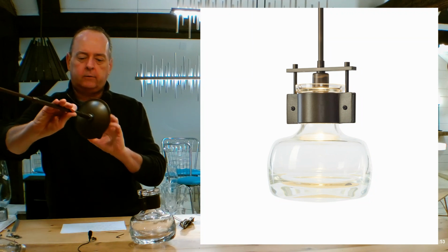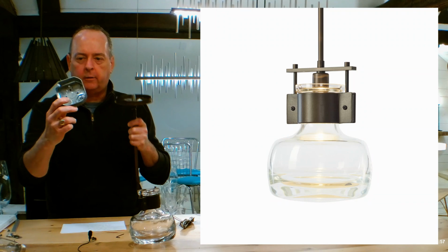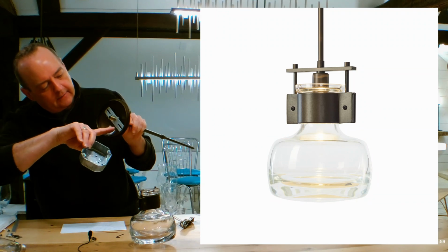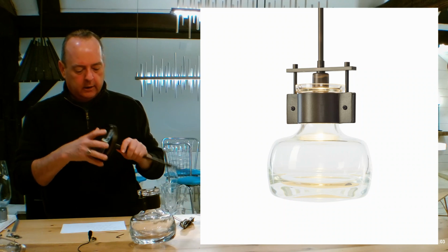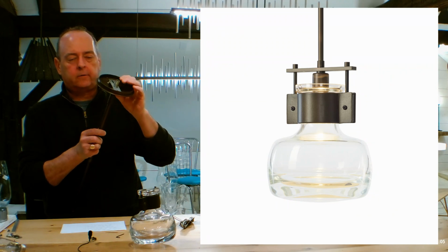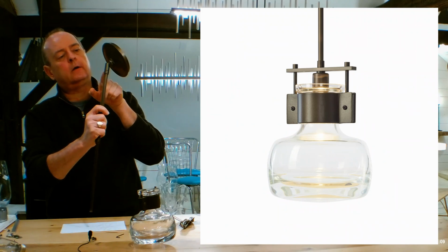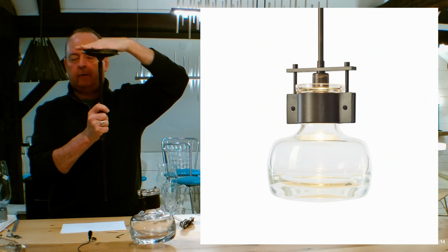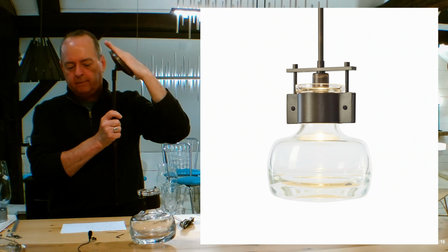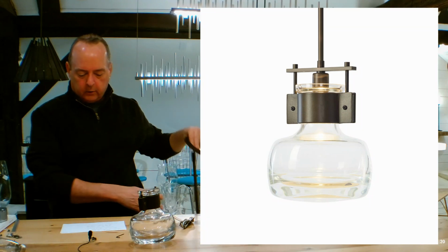5-inch canopy, round, that's going to be going on the ceiling. Goes over your 4-inch junction box. There's a bracket on the inside of this, and that's how these all come together. It's going to show you that on that paperwork. It's also going to show you that this is slope ceiling adaptable to 45 degrees. There's a knuckle right here built at the top of this and allows this to bend. So it can be flat on a flat ceiling, and it can be up to a 45-degree slope without a problem at all. So no special things are going to be required.